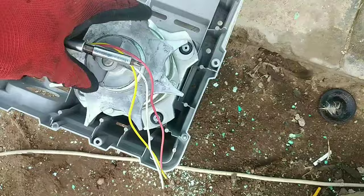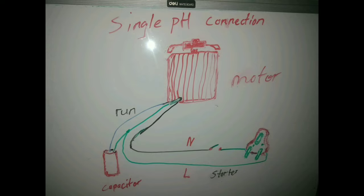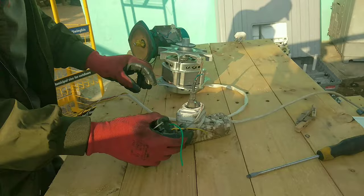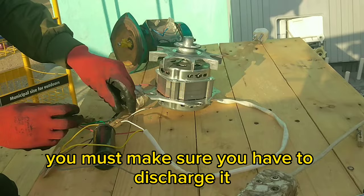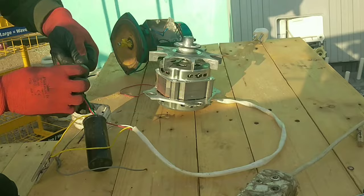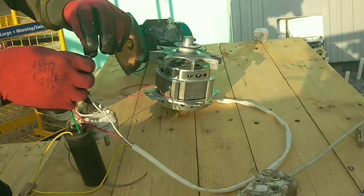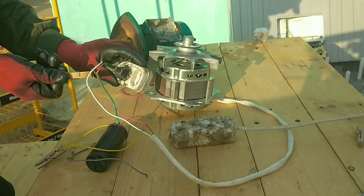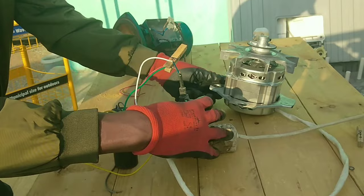Let's drop down those three screws. I'll put up a single-phase wiring connection diagram for you guys to understand how to connect your single-phase motor for bench testing. Before using a capacitor, you must make sure to discharge it by touching both cable ends or each terminal with an insulated screwdriver while wearing gloves for safety reasons. This is how to simply do your connection.